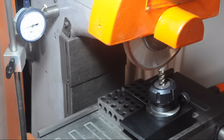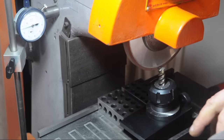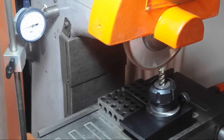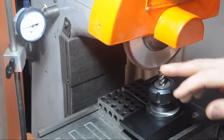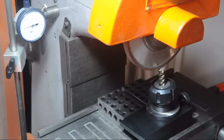If it was a high-speed steel end mill, just lop off the bad part and grind a new edge on there. But I'm not sure what this grinding wheel is capable of, and I think I have less material to remove if I start this way. Maybe I should have just lopped it off and this is just adding some confusion. But this wheel might technically only be for sharpening and not for full facial reconstruction.